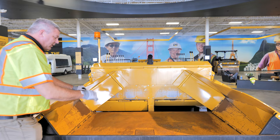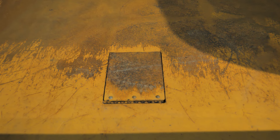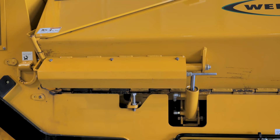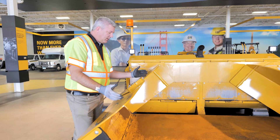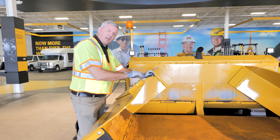Also in this area you've got a flip door here that allows us to get to the fuel tank — diesel fuel tank — so you just want to take your knife or your spatula or whatever you use and clean that out so you can get that door open. As we're looking at the hopper here, we've got multi-functions on this particular hopper as far as raising and lifting up the hopper itself. With that motion, you've got this area down in here — we want to make sure we don't have a bunch of mix in there getting it into a position where it will seize up. So keep this clean and keep it lubed.